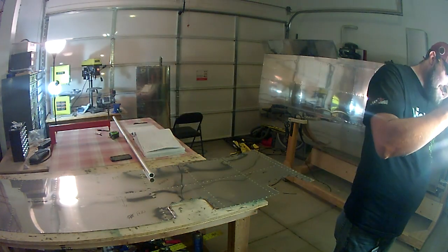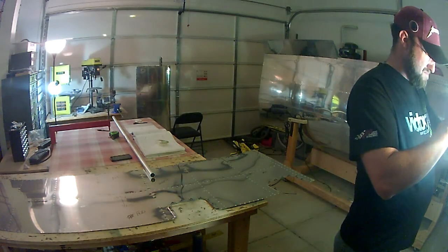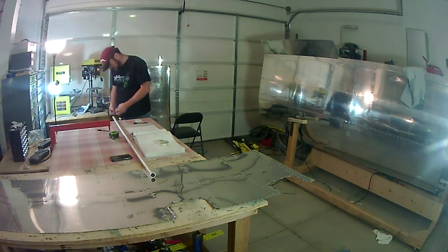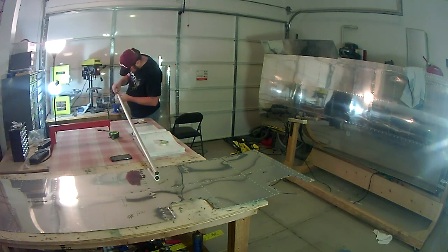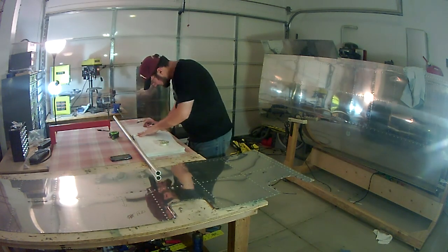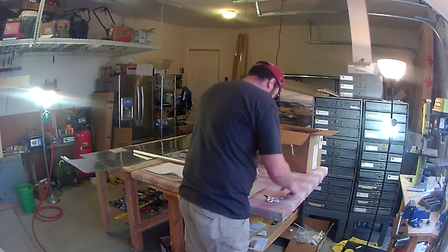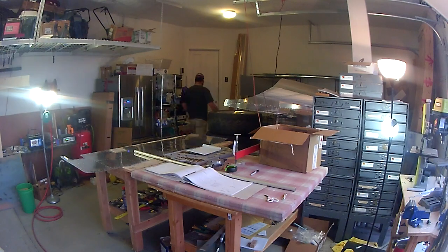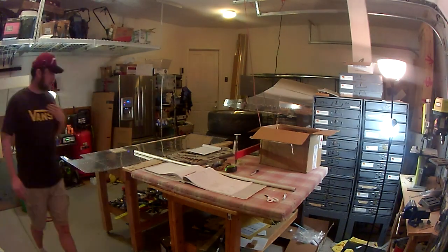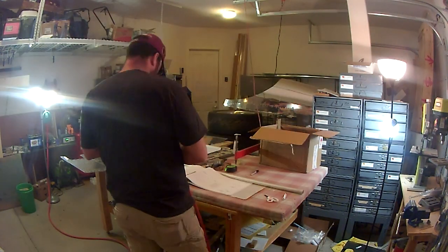None of this is pre-drilled — you have to create all of these holes yourself. What you see me cutting out here is the template to do that. It's basically a strip of paper with six different targets along it. You line it up so that one edge is flush with the end of the torque tube, tape it in place, then use a center punch to make a mark at the center of each of those six targets — that's where you drill your holes. The easiest method I found is a spring-loaded center punch: you place it and press down until it snaps, punching a clean mark so your drill bit won't wander.